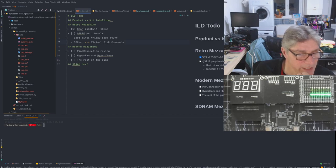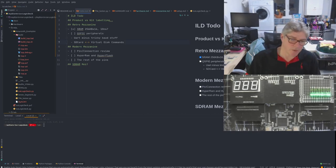So Laurie was just saying getting 100 megahertz access from the SRAM makes the HDL harder. You have to follow Tom Verbeure's examples to configure the I/O pads. Okay, it's a long time since I looked at that. I will take a look at that. I wonder if he's doing the 8 to 16 thing there. Possibly.